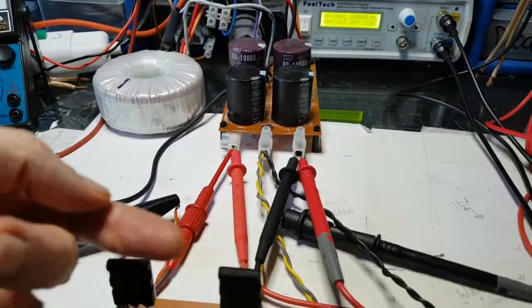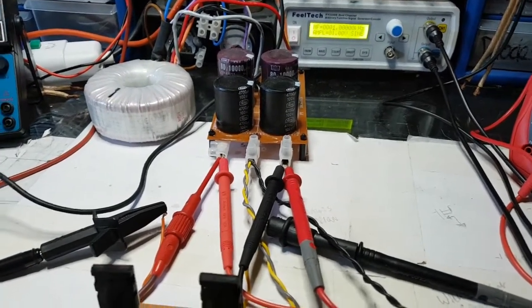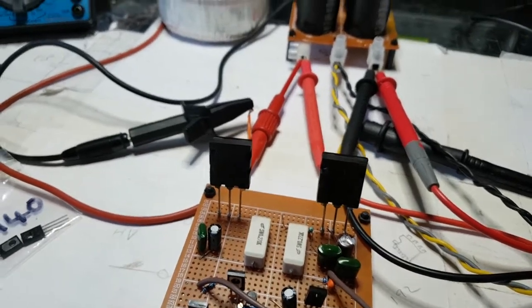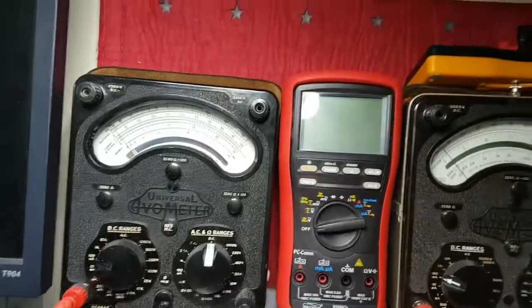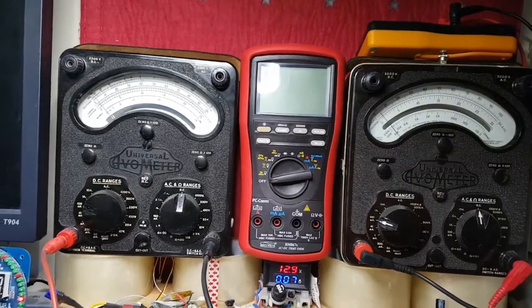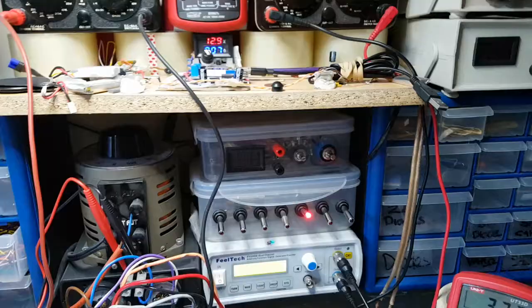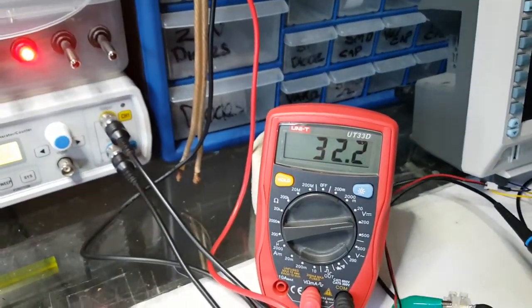Do another temperature check. Nothing, but that wasn't really making any sort of adjustment to the current being drawn. So I need to go over those connections again. There's nothing horribly wrong, but there's something not quite right. So I'm going to take another check, have a little look at that. And just to say, it's not rushing down like there's a short at all.